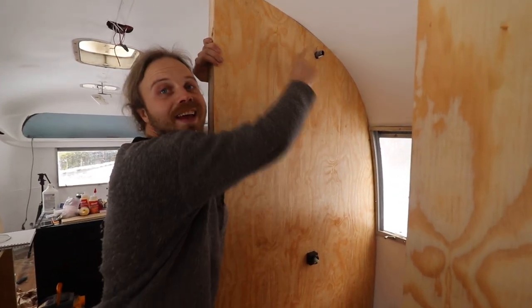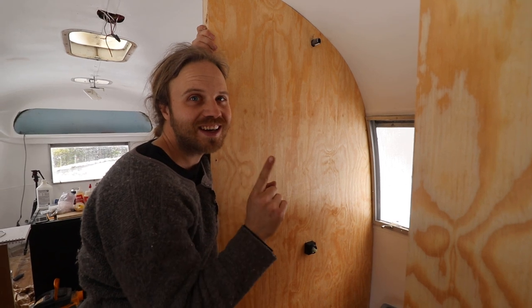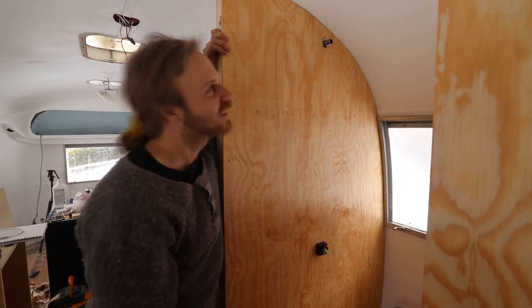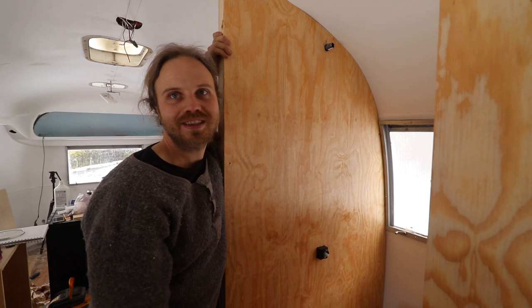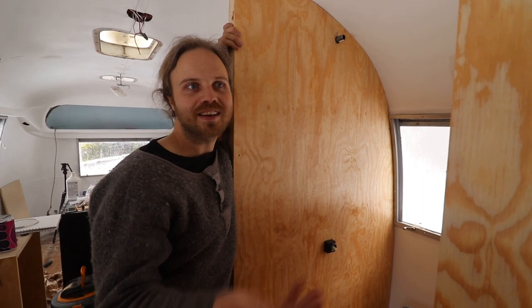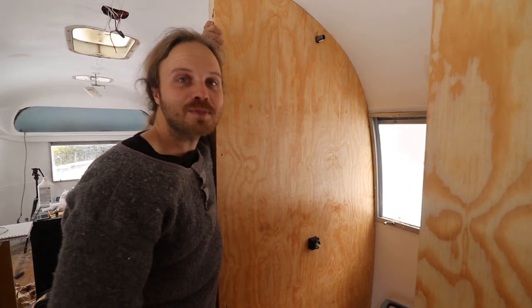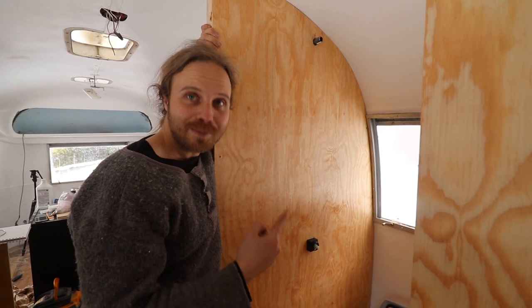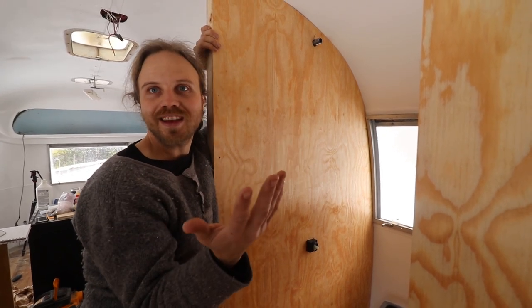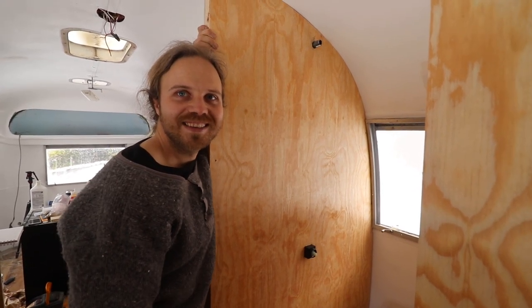Got it. Yay! It's a miracle. We managed to get the shower head and the shower handle lined up and screwed into the rear wall first try. And I gotta give full credit to Allison for coming up with the winning plan to get everything to line up. She said, why don't we just dip the backs of them in paint and stamp them against the wall through the holes so that we know where they sit? And I was like, you're a genius. Brilliant. Thanks, Dave. And look, first try. So any aspiring plumbers out there, hot tip, stamp your faucet backs and then just press them to the wall all together and you can see where it all lines up. Or just hire Allison. She does consulting for plumbing now. Good teamwork.